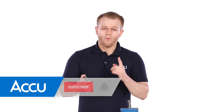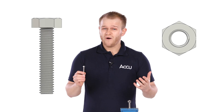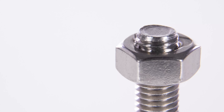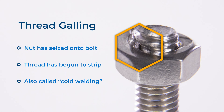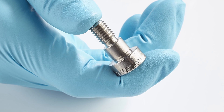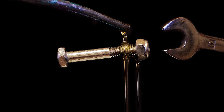Before we get into them though, one important thing to be aware of when using locking nuts is thread galling. This is where too much pressure and friction on installation causes the threads of the bolt and nut to seize together, making it almost impossible to remove them from one another without having to either cut the bolt or split the nut. As you can see here, our lock nut has seized onto our bolt and the thread has actually started to strip. Pro tip: this can be best avoided by using components of two different material types. But if this isn't possible, try cleaning the components beforehand using a lubricant and slowing down your installation speed to reduce heat and friction.